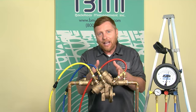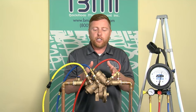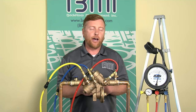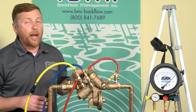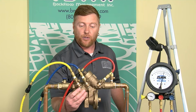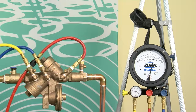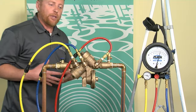Now it's appropriate to look at the static pressure differential across check valve one. I'm going to maintain the back pressure on the backside of check valve two. This final evaluation will lift check one — after I lift it, I'll allow it to reclose and observe what the pressure differential is across check valve one. To lift check valve one, I open the low bleed needle valve so the gauge needle rises above the apparent pressure differential, then close it. My gauge appears to be stable at 9.5 PSID. Check valve one is maintaining a static pressure differential of 9.5 PSID.